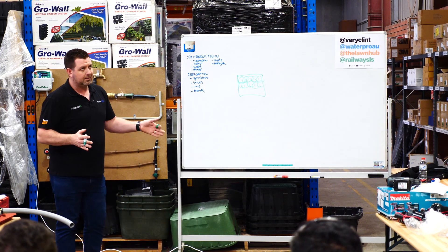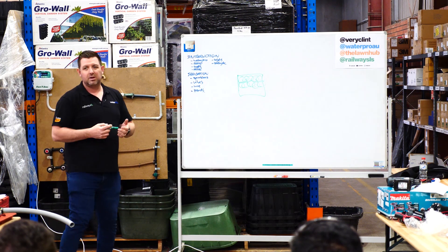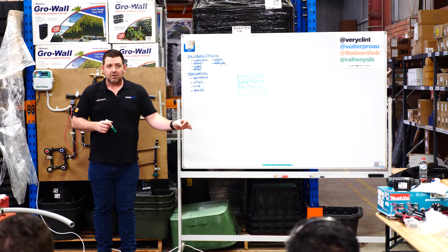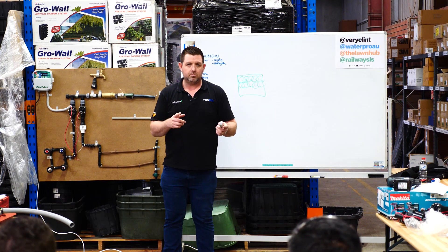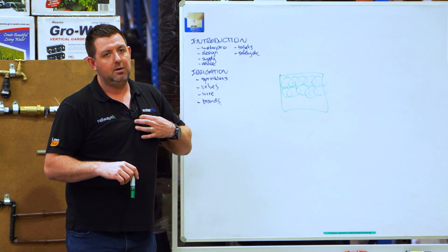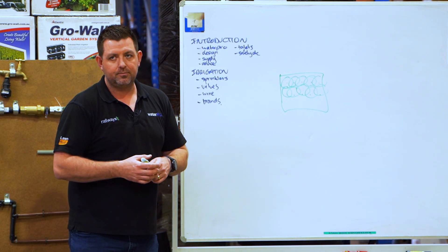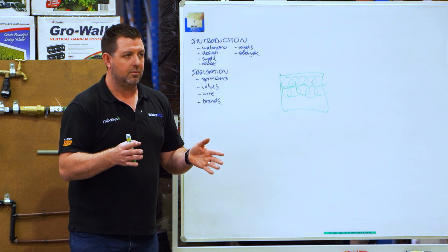When you do 0.4 by 0.4 at 1.6 litre, which is Netafim — which is probably all you'd really be seeing — do you have a brand of tube you're using from memory? Netafim is really smooth, there are no lumps on the pipe. The lumpy one is Toro, so there's 2 litre and 1.6 anyway. That configuration will deliver about 17 mil an hour of equivalent rainfall. Not all soil types can take that, so your I-20s might be doing 8 to 11 mil an hour if they're designed properly.